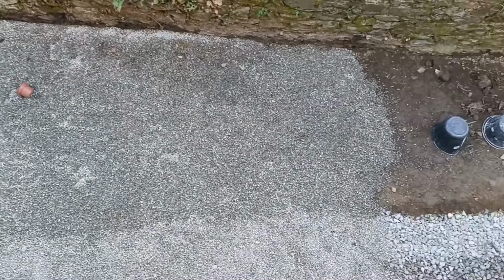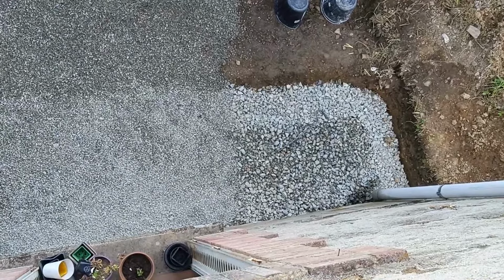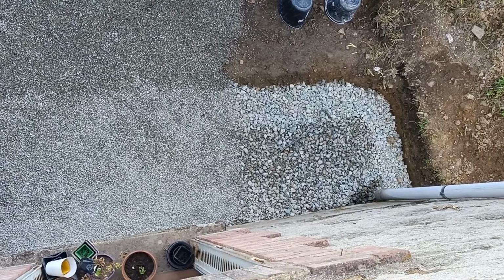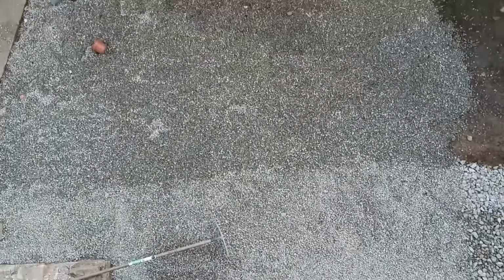Morning, girls. Something I just noticed here, we had a little bit of moisture overnight. It wasn't rain, I don't think. Anyway, you can see clearly that the inside layer is drying quicker than the outside layer. Under the outside is just soil, and in here you've got a layer of stone with a camber going towards the drain. And it is drying faster than the outside.